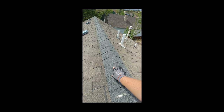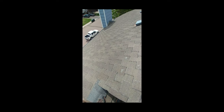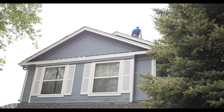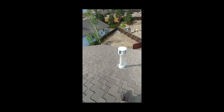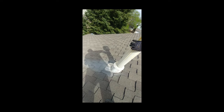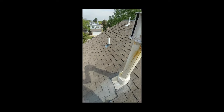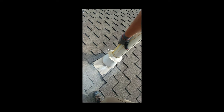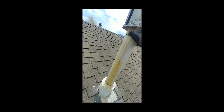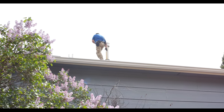They've done some maintenance here — different colored shingles on the ridge cap. It's not a bad thing; it's in good shape, they're maintaining the roof like they should. The bee vent over here has some rust coming down — if you paint these they last a lot longer. It's had some hail damage at some point. No holes, I can't stick my finger through it, it's just normal rust, so just recommend they paint it once a year.